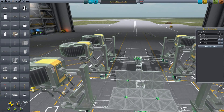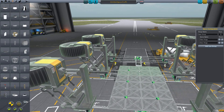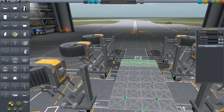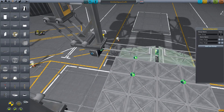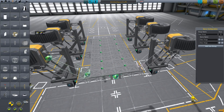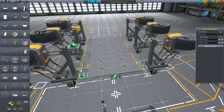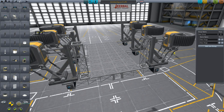All the weight will be distributed on the girders and not on the wheels, because in my previous designs on this crane I completely messed up. With the weight being on all those wheels it just ended up really falling apart constantly. The suspensions from the wheels would absorb things but not evenly because the arm was on one end. At least with the girders it provides some stability to the ground, and I ended up sticking some smaller girders on each end horizontally to stabilize the thing even more once it's in crane mode.